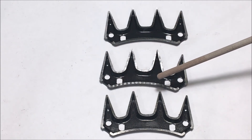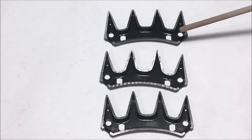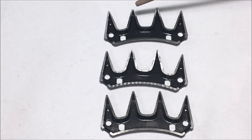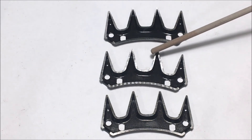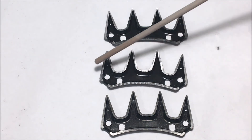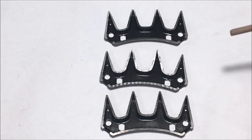This cutter has rubbed across the heel, all the way up both sides — it's hitting flat, and that's the result we want to see: rubbed at the tips and rubbed at the heel, hitting flat. This other one has rubbed the tips quite heavily, which means the grinder is set too far in. So we want to adjust it in and out until we can see it's rubbing the whole face of the cutter. A little bit of mucking around — two minutes at most, using a handful of cutters you're going to grind anyway. Once it's right, lock your grinder up and it's set.